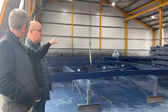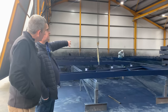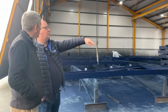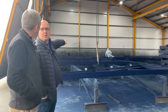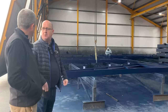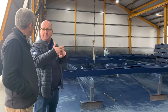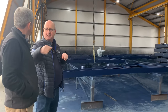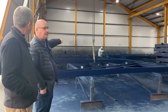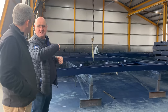It's a slow process — when the stuff comes back from the galvanisers it has to be washed with a special liquid, then washed with water, taken back into the paint shop and dried, and then you start your three coats of paint. The sprayers are all airless sprayers pumped from the machine over here. It's actually pumping paint straight through a pipe — the noise you hear is the paint coming out of the gun, not air. On the old guns you had an air pipe and a paint pipe and the paint was sucked with the air. This is a pump pushing the paint through a hose with nothing coming to the head of the gun but paint.